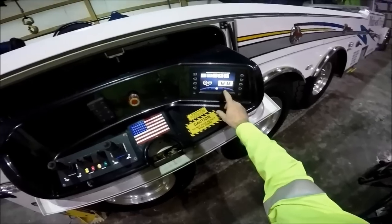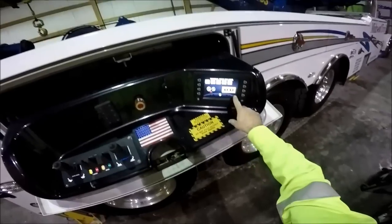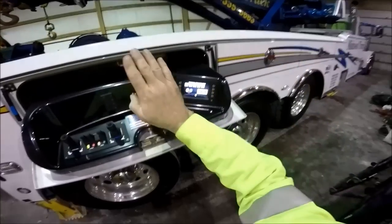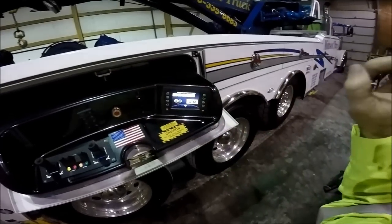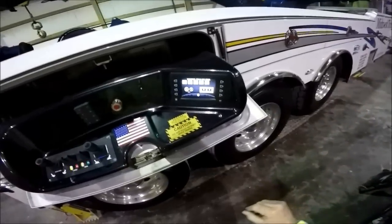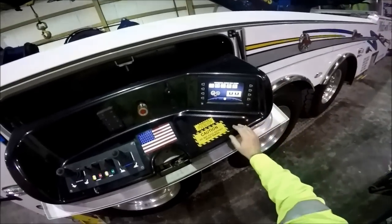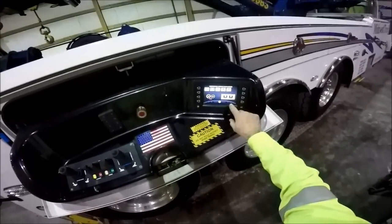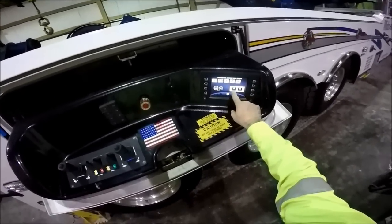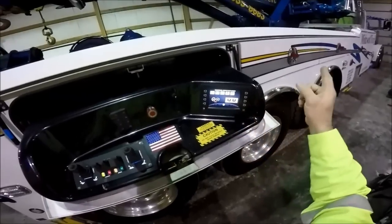This is also where you have your house lock, and on the 1150R roller, you have a travel lock. The house lock keeps it from rotating — it will lock in the rear position or lock at 180 degrees pointing forward for traveling down the road. When you hit the control button on the main control pad in the cab, it releases the house lock. To allow the boom to roll, you have to go to this screen on either of the two main control stations and hit the travel lock release. Otherwise, the boom will not roll back.